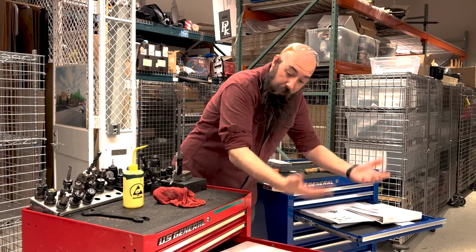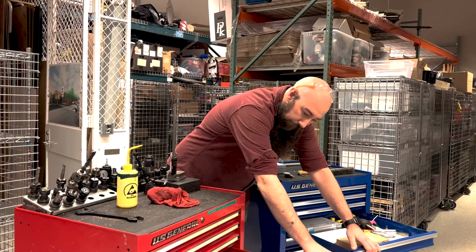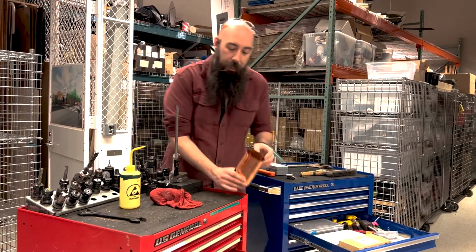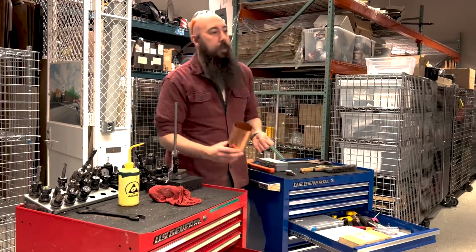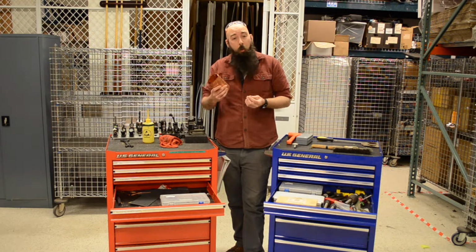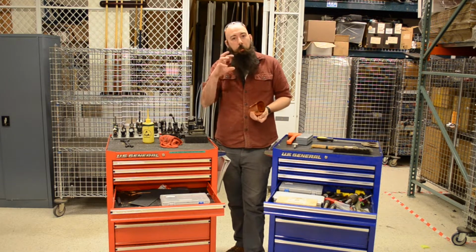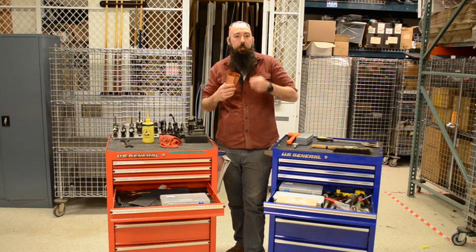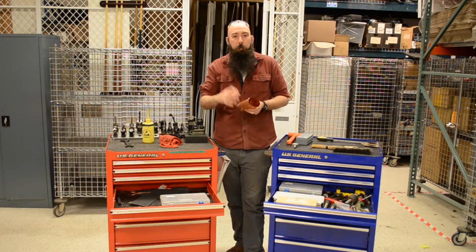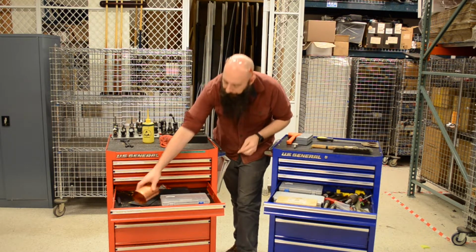Third door down, machinist manuals for our machines in particular. One thing that is really nice to have is just some scrap copper. It's a little machinist trick that you can use if your part isn't exactly square, just a material that'll form, or if you're holding something in a vise or in a chuck that you don't want to mar the surface, you can use something like this or a soda can that will actually get deformed but still grip your part, and then you won't have those chuck teeth marks on your stock.